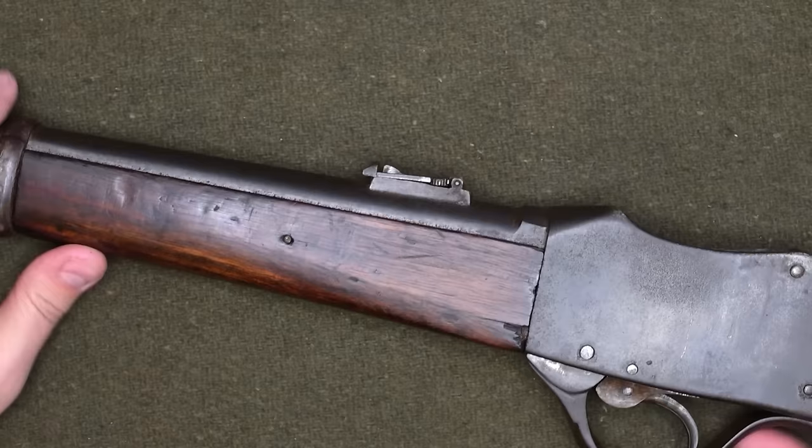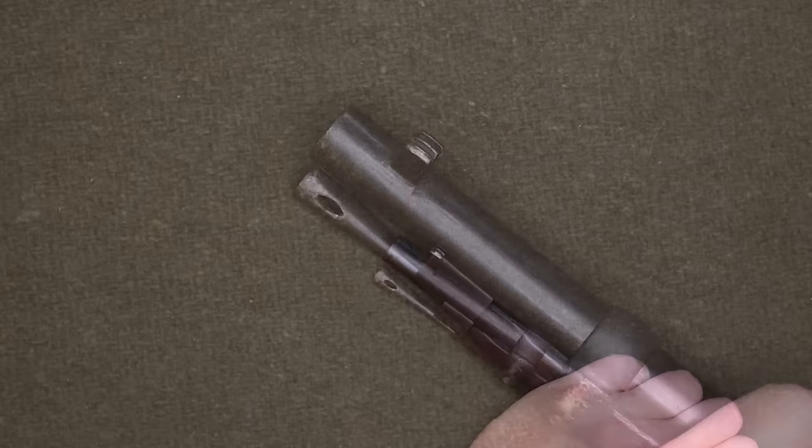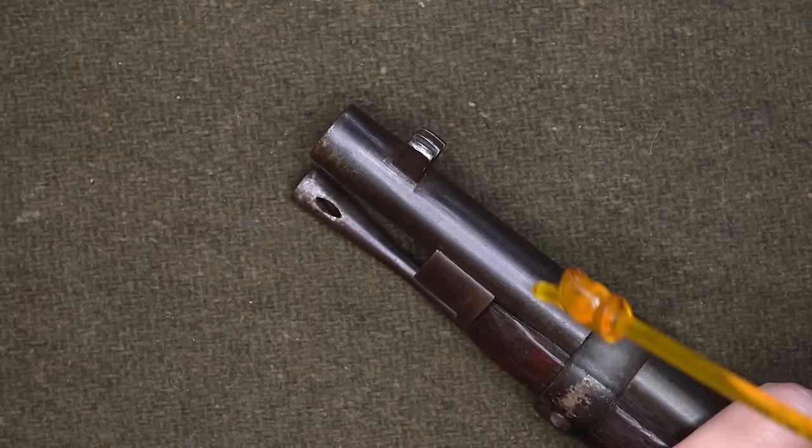So not a huge difference between the carbine and rifle in that regard, if that's true. Unfortunately, I have not sat down and translated all these. If we bring her on back, it's definitely a Martini carbine styling all the way to the front, in which we've actually borrowed the Martini carbine front sight. That's a barley corn front sight with two sort of protectors. They're almost lower than it. The whole assembly is actually dovetailed into the barrel, which leads us to believe that these were cut down from original rifle barrels. Given the small numbers of production, I doubt they were a dedicated production batch.